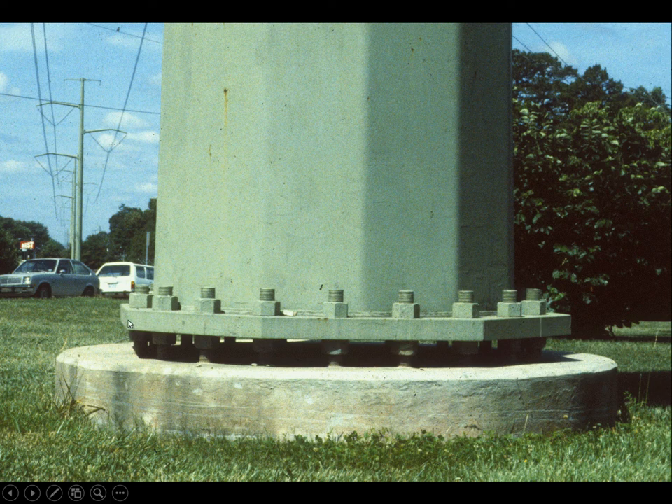This is the moment connection at the base, which consists of many anchor bolts that go deep into this concrete footing. This particular footing is five feet across and goes about 40 or 50 feet down into the ground. The ground is augured out and the concrete fills in, then this column becomes an extension of it. This is a classic example of what Frank Lloyd Wright used to call a taproot model of a column, where it's the soil around this thing that keeps it stable — or you could call it the fence post model.